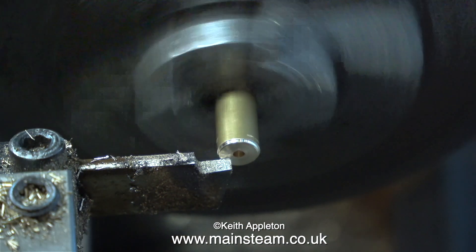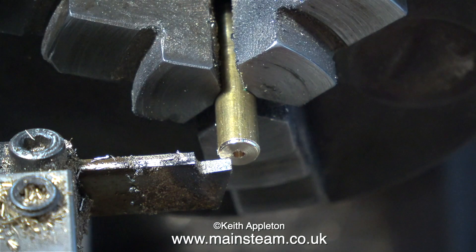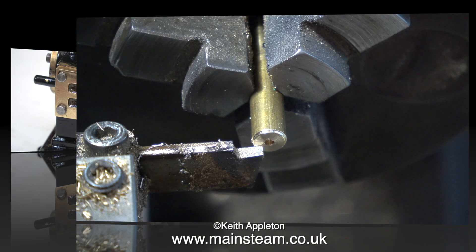There are different ways to grind the parting tool. This one is ground pretty flat because I often use it as a turning tool, so I need it to be perfectly square on the end. It is possible to grind the parting tool at an angle so that when it parts off the component it doesn't leave a burr, but this way you get a bit of a burr — not a big issue. The burr can be easily removed on a piece of wet-or-dry sandpaper.